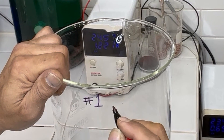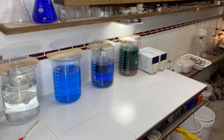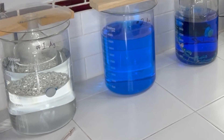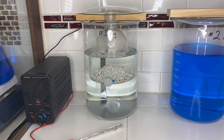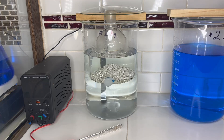Last time we went over how the copper cells dealt with our silver plated items. Now let's look at the silver cell. I do a clean out of my number two silver cell after running over 100 ounces through it at one time, dissolving 925 sterling pieces right in the cell and getting out pure silver. I also run XRF testing on the silver and discuss differences in purity and how you can test yourself at home.